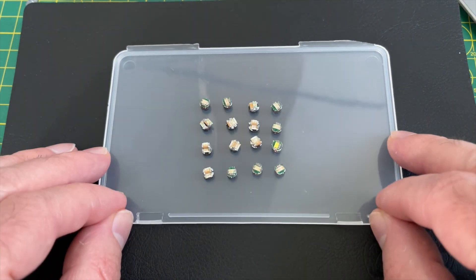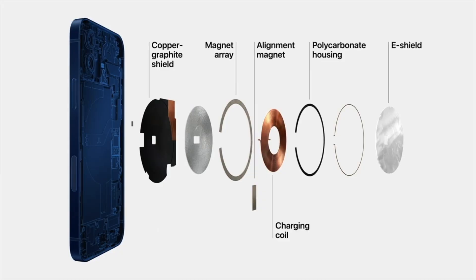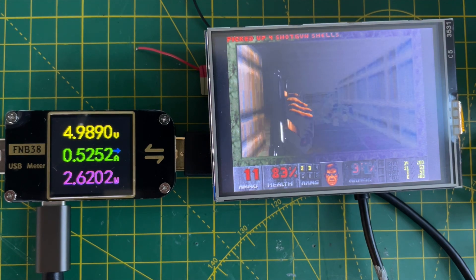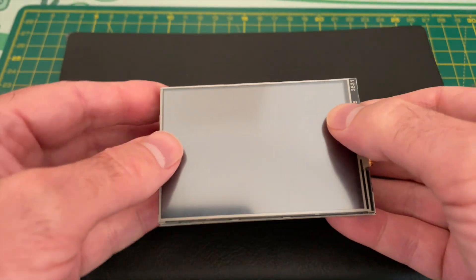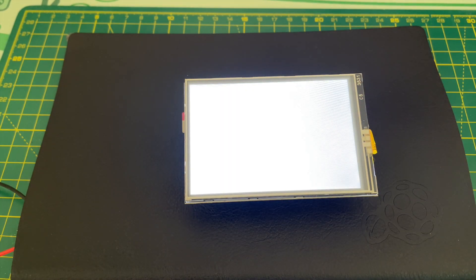The main issue is that when you can't see the coil it's quite hard to get good alignment. This explains why a lot of wireless chargers have locating magnets to snap your phone into position - without them you get a pretty ineffective charging system. Something to think about for future projects. Now what can we do with this? Obviously we can't just have our Raspberry Pi only working when it's sat on top of the transmitting coil - so let's make a complete wireless charging system with a battery.